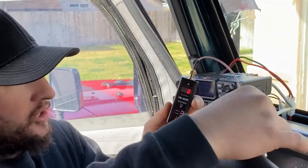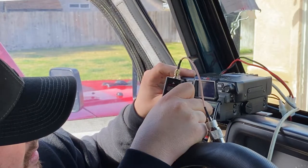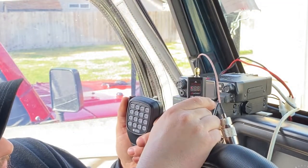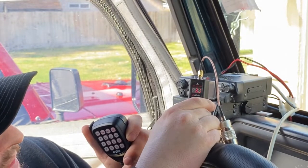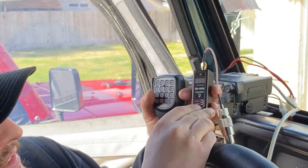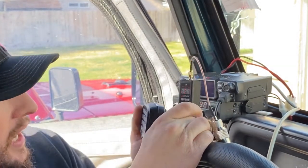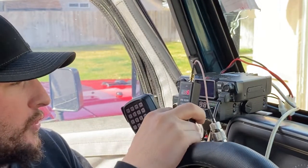With some excess cabling it may not be perfectly exact, but it'll get us in the ballpark. Going back to channel 2, on low range — I'm getting 3.1 watts output and climbing. Switching to SWR mode and keying the mic — I'm getting about 2.8 SWR, which is okay but not ideal. There is no perfect system, but let's see if we can improve it.